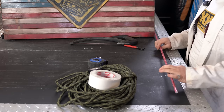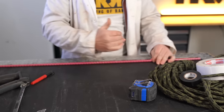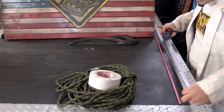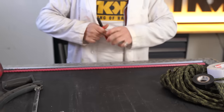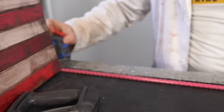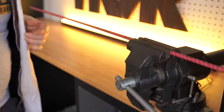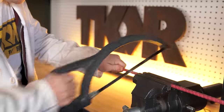The first thing you need to decide is how long you want your sword. My favorite is 33 inches long, so what we're gonna do is take an inch and a half off that measurement, because by the time we're finished we're gonna add some additional material, and so our core length will be 31 and a half inches. I'm just gonna mark that here and we can go ahead and cut that. We'll just clamp it not too tight — we don't want to break anything, just enough to be sturdy. Here's my mark, and we can just take this hacksaw.